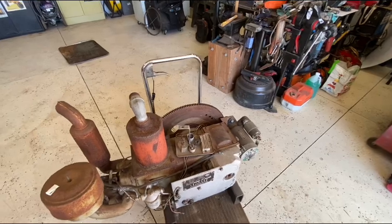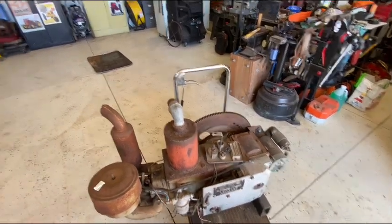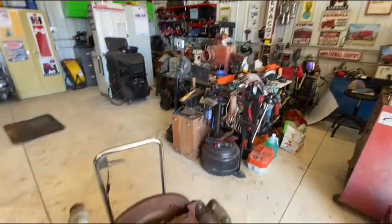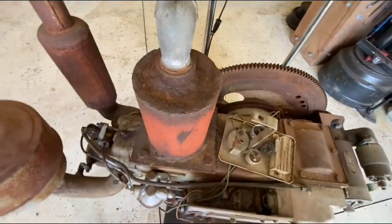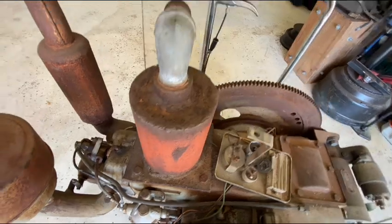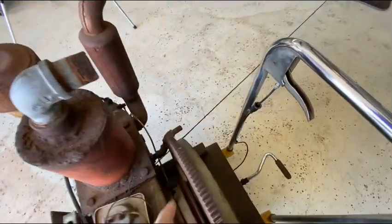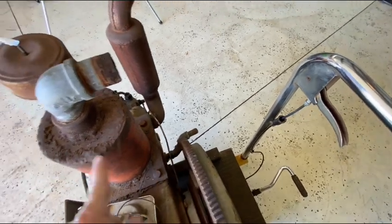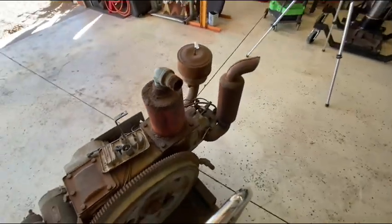This is a hopper cooled engine, like the old hit and miss engines, and unlike my International LB engines. It's hopper cooled, but somebody did a fabulous fab cobble job and looked like they set it up for a recirc of some type, because there's a connection down there, a water connection. But I'm just going to plug that. These were designed to be hopper cooled.